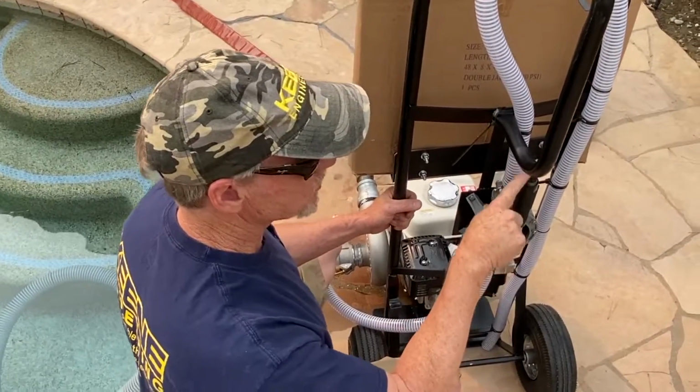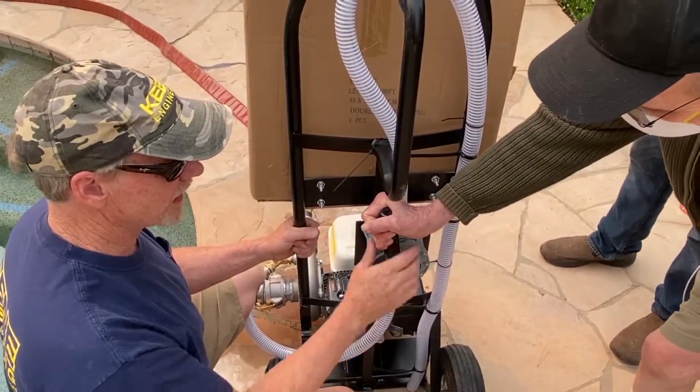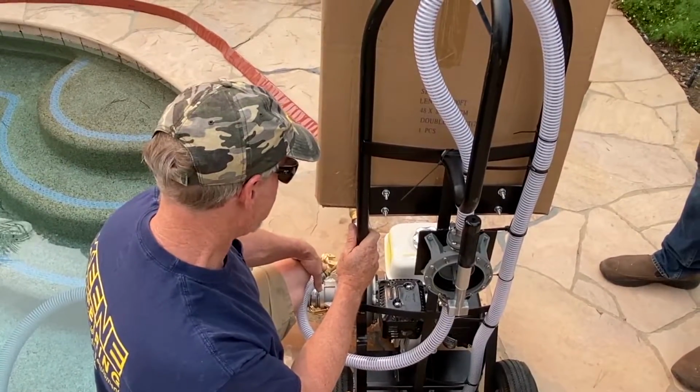Okay, just pull gently on this real quick. See, it's kind of hard. Not sideways. Pull straight out. That way. Yeah, feel it's kind of hard. Okay, don't go any harder. So that tells me that this ball valve is closed.